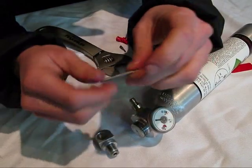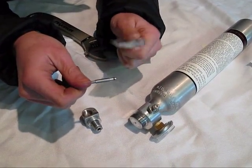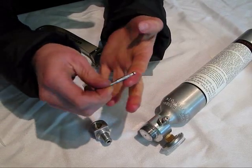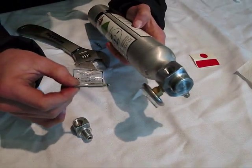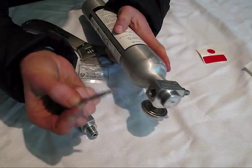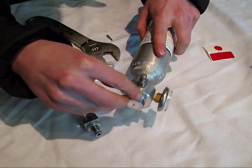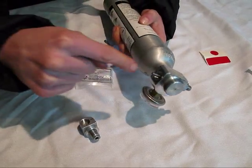The next step is putting the piston into the cylinder. I'm going to use a bit of grease — not too much, about that much. Lube it up, then put it right back in. O-ring goes in first — in, not out. If it doesn't click right in, you can gently press down on it on a hard surface, and that will get it in there.